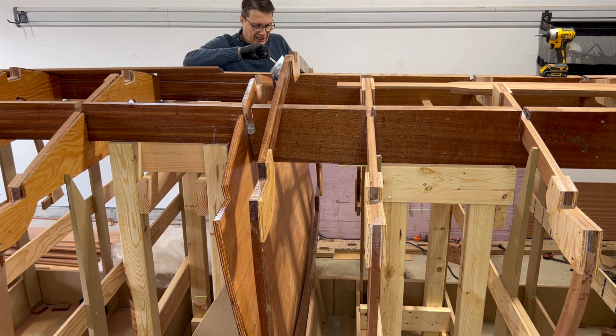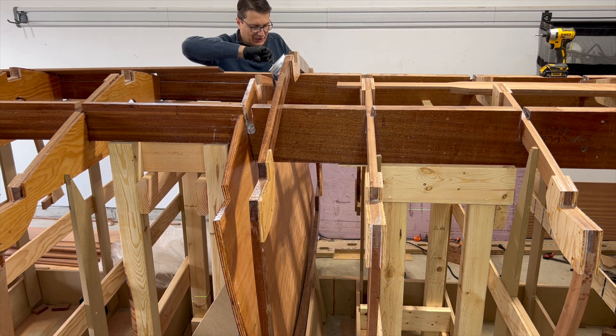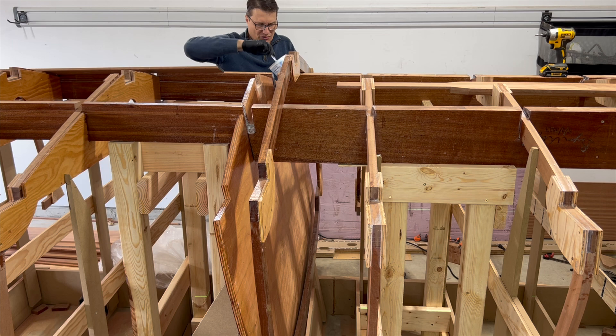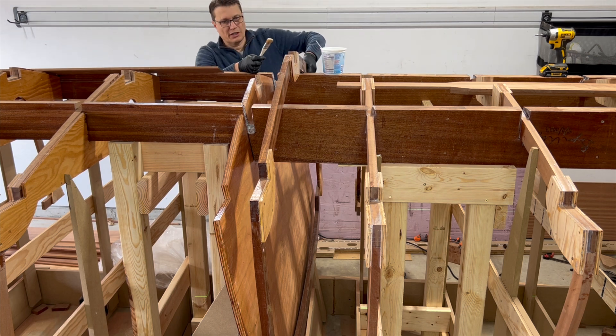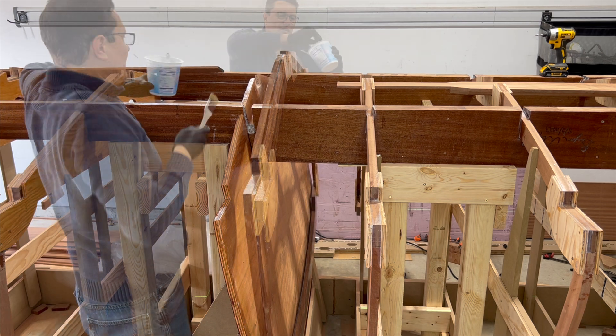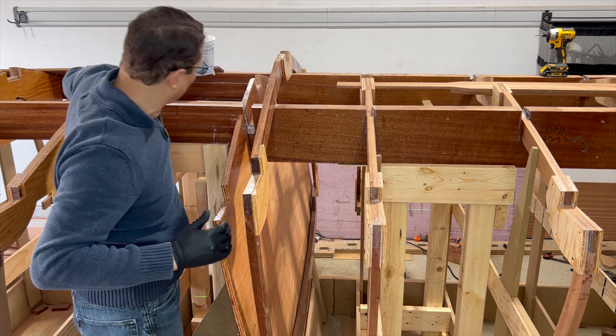I'm mixing different viscosities of filler. The thinner stuff goes into the groove well but later squeezes out, so I start with a thin, high-density thickened epoxy — just enough for a nice thick coat — and then make really thick epoxy to fill the large gap. I coat the surfaces evenly: first unfilled, then modestly filled epoxy for a good thick coat. I also need to bond this frame to the bulkhead — my first time doing that — so I coat that surface too.